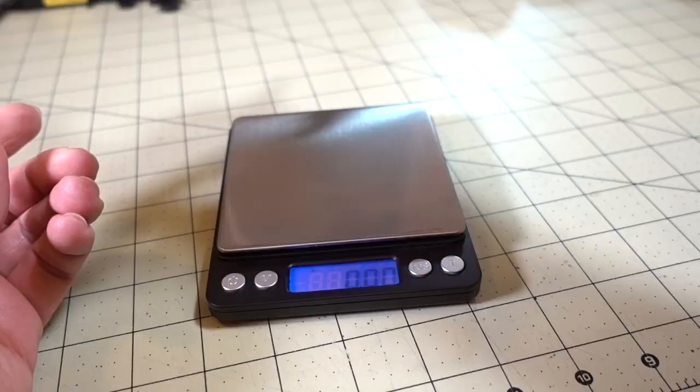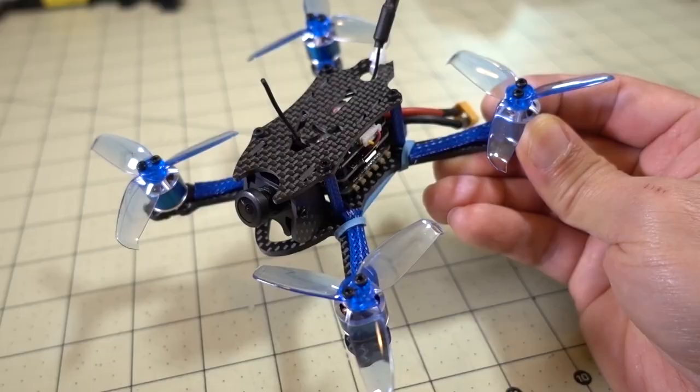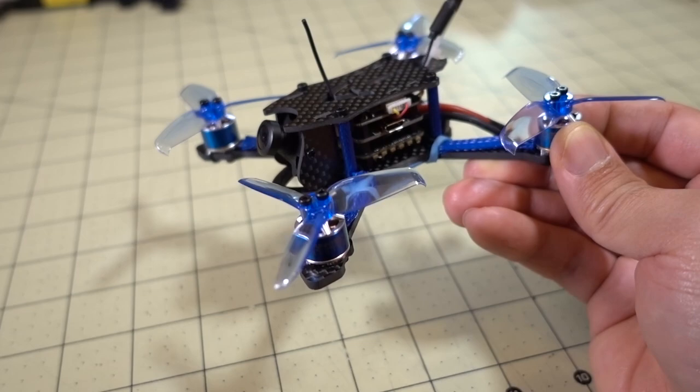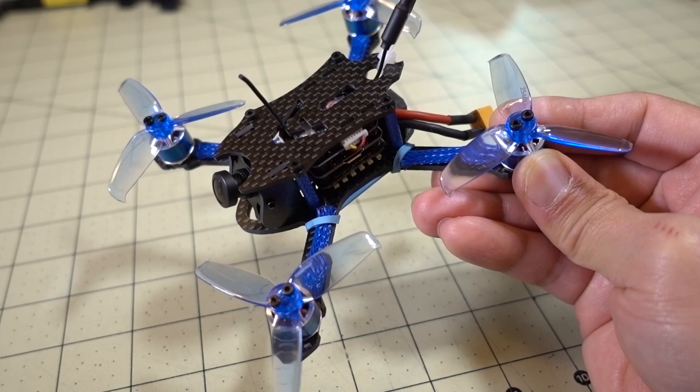Okay, we'll get a weight measurement of this, and it comes in at about 93.2 grams. So at about 92, 93 grams, that is a little bit on the heavy side, but I think you can attribute that to the 1106 motors. And I would definitely recommend flying this on 3S with like a 550 3S or somewhere in that range, maybe 600 3S. And I'll list the battery that I flew in the description.